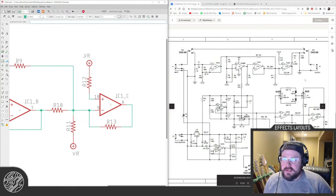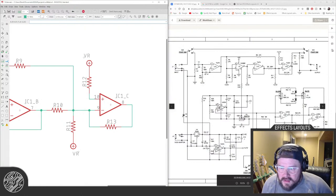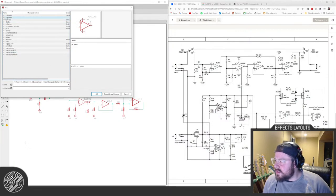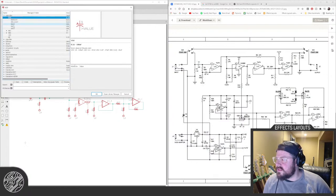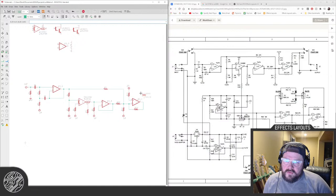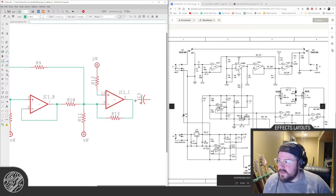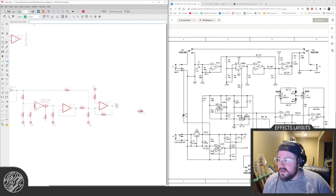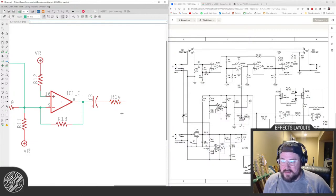Okay. All right, the audio path is almost done. It's a 2.2 uF. I usually don't put in values of stuff until, I probably said this in the tutorial, I am finished laying everything out or drawing up the schematic, so then I can easily copy and paste parts. I'm going to have to edit it one way or another, and that way I don't forget to modify a value, so we'd have hopefully fewer typos in build docs and just make the circuit correct.